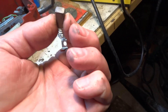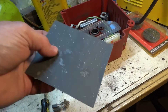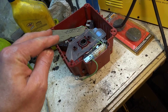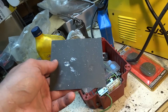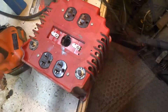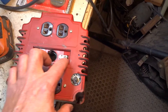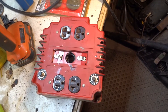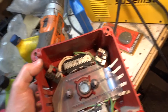When I put it back together, I'm also going to cut a block of wood the same size as this and use it on the contact surface of the armature, which is a weird looking beast — I will show you here in a little bit. Put the brushes back in. They go in from the back side here — there's one, there's the other. This one runs on the inside race, this one runs on the outside race. This is a different kind of generator, but I've seen them before — I've never seen the insides of one.